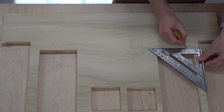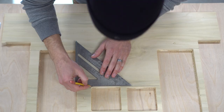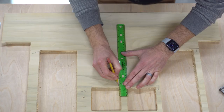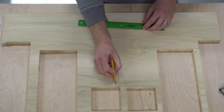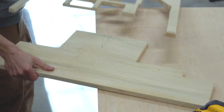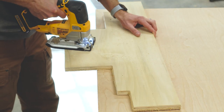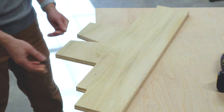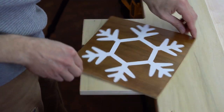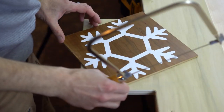We're going to build a coping saw cutting table. I found a scrap piece of plywood from another project and I'm drawing lines to cut away the waste, then laying out a bird's mouth or v-notch — this will be where our coping saw goes. Using a jigsaw, I can quickly cut away the waste material and then cut out that v-notch. Now we can go back inside, clamp this to our table, and start using our coping saw.